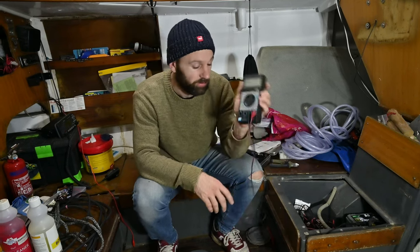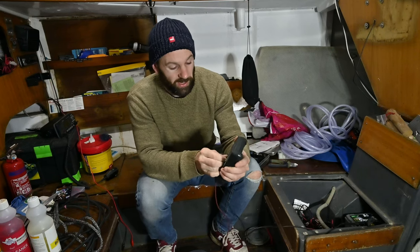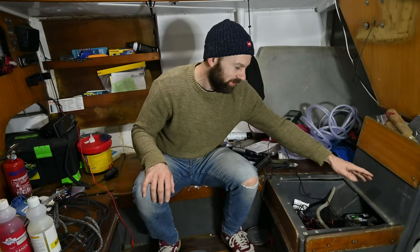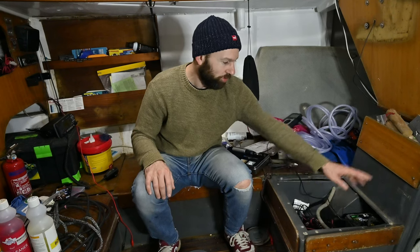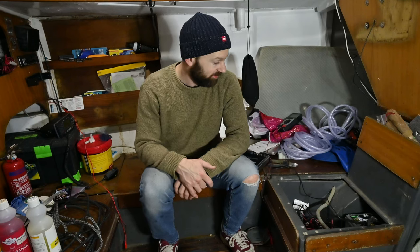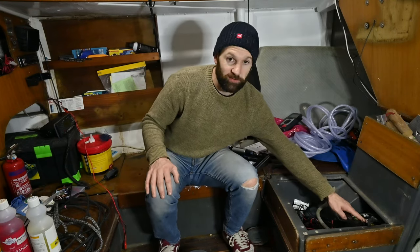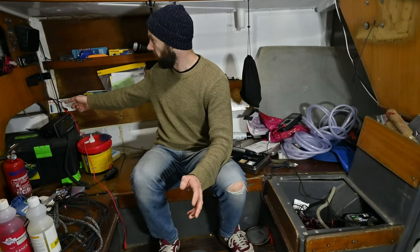I think I know why I don't trust the voltmeter — I changed the battery in it just the other day because it was dead and I put a half-dead battery in, which now appears to be fully dead. Right, I did a continuity test: I set this to resistance and stuck the probe onto the negative terminal and onto the negative wire extended with a crocodile clip — it read 0.005, so it's reading continuity. But when I stuck it on the positive terminal and measured across to the positive of this side, there was no continuity. So the problem is somewhere in the positive line.